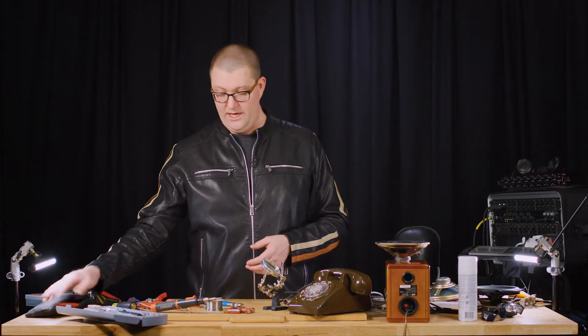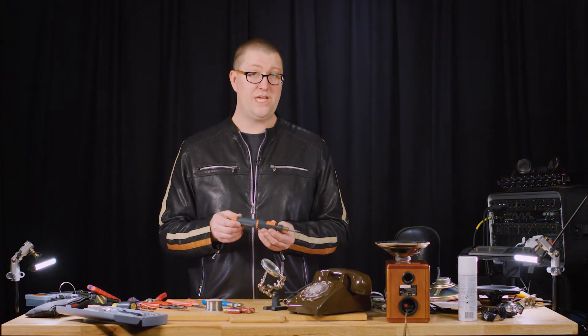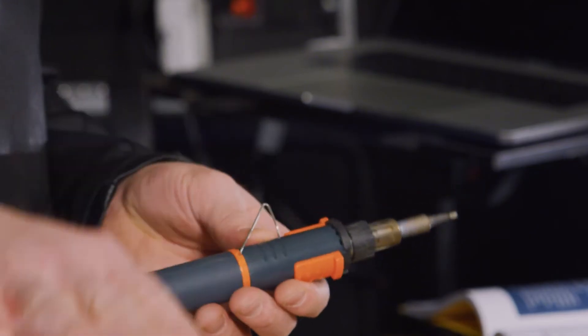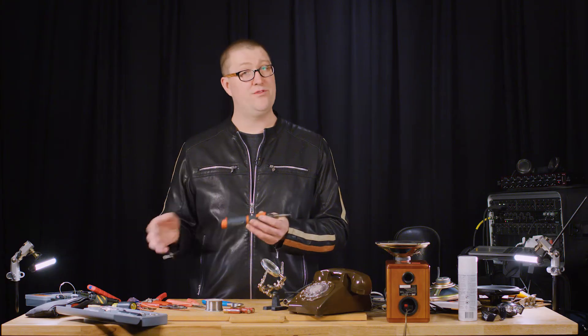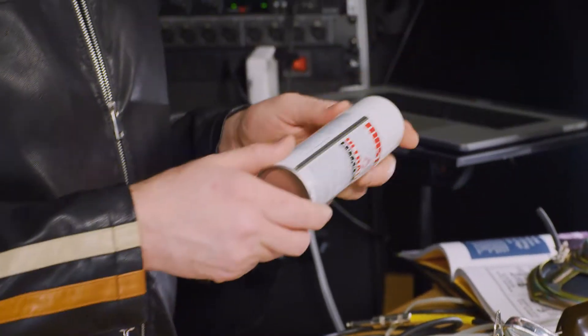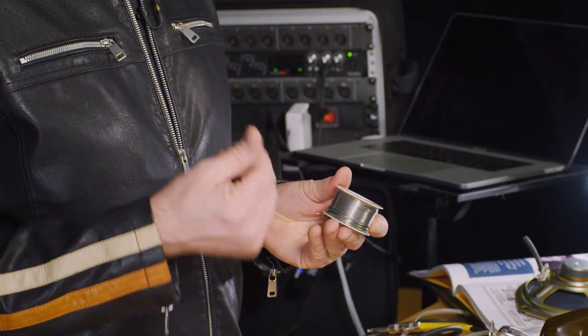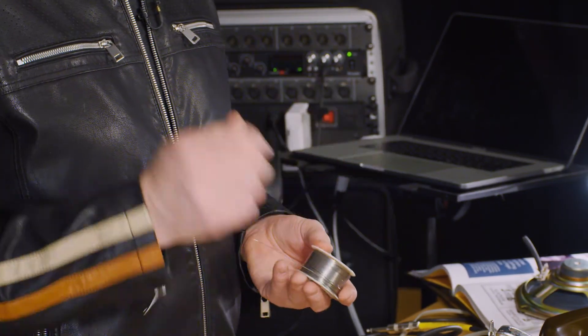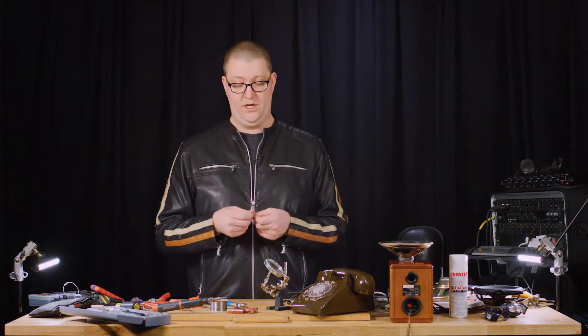A couple of screwdrivers and you're good to go — it doesn't take much. Soldering can be kind of intimidating when you first get into it, but you really only need a couple things: a soldering iron. A lot of people use electric ones, but this is a butane one. I like it because I can bring it to shows, keep it in a bag, and fix things behind a rack without having to plug electrical supplies in. Also there's no wire hanging off the back, so I feel a little safer. Then some solder — you really want to get flux core solder. Flux is a chemical that cleans and deoxidizes as you're soldering, making the soldering go better. The one thing that can be a problem is if the contacts you're soldering aren't clean, which can make the solder joint weak. Flux core solder really helps with that.